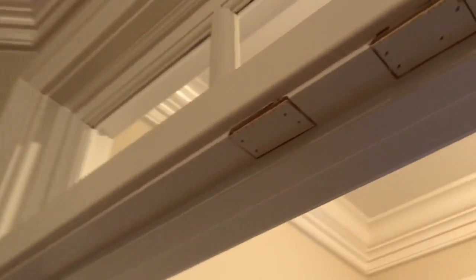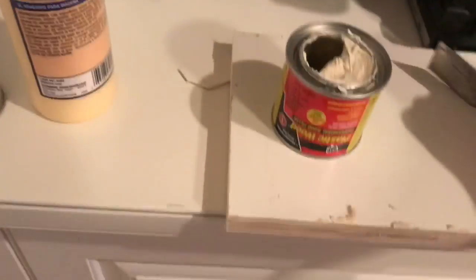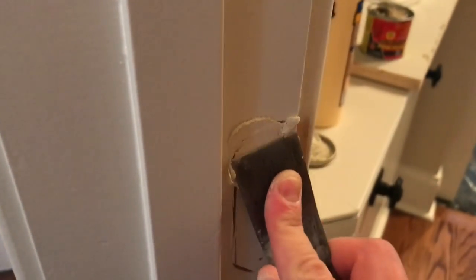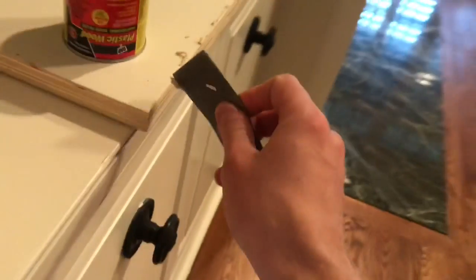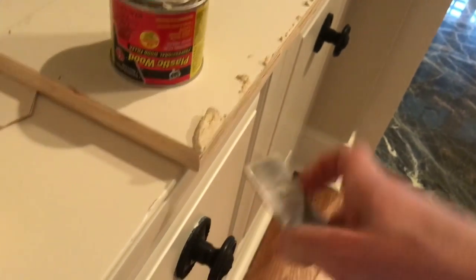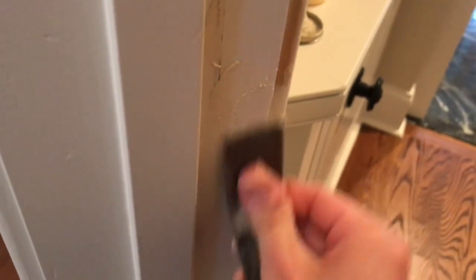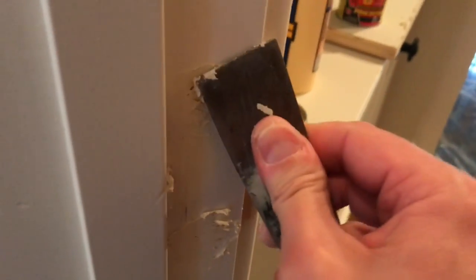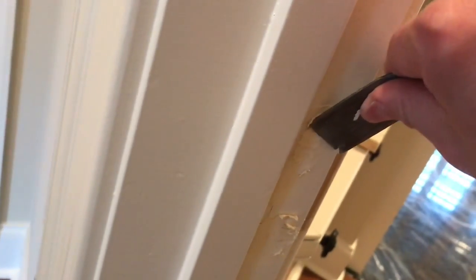You can see them all installed on the left side. It's okay if you have little gaps around the insert — we're going to fill those in. You can also see the ball catch inserts up above. To fill the spaces around the inserts, I'm using a product called Plastic Wood — it's basically just a putty. I've got some on a 1-inch putty knife. It's a messy job but pretty easy — you just trowel it into the gaps, brush off little excess parts on a hard piece of wood. It dries really fast and turns kind of flaky, so it's okay if it falls on the floor. Just don't step on it. I try to trowel it from every angle and pull just a little bit of the excess off so you don't have too much residual putty sticking to your surfaces.